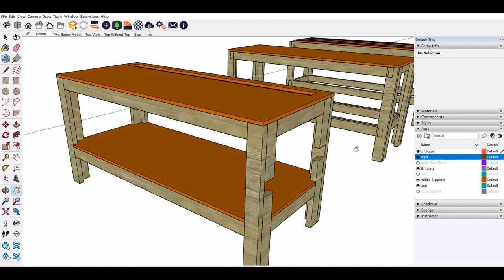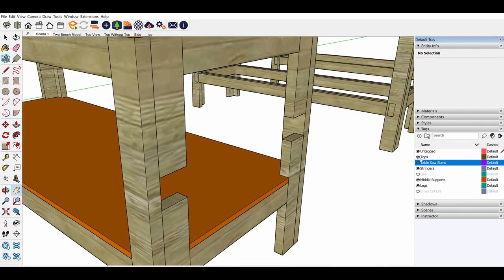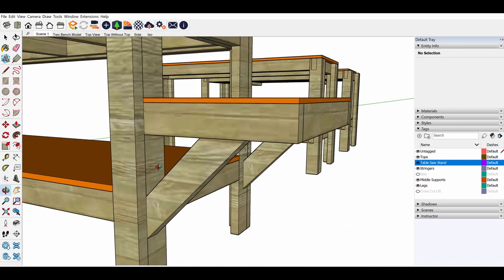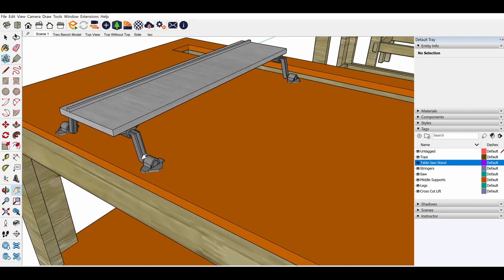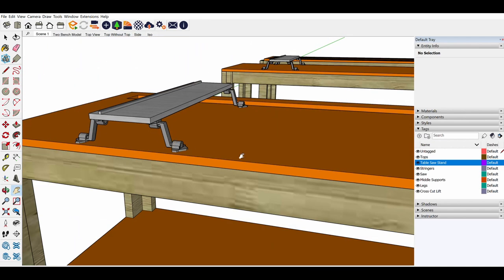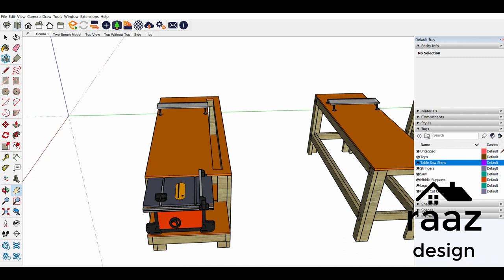Then add a sacrificial top - I use three-quarter inch plywood because that's what I had. I just screw and glue it so I can replace it when it gets too beat up. For the table saw stand, I notched out a little bit of the leg so I could run a support through and screw that in really strong, then add kickers. If you're interested in making this, you can download the plans on the website - it'll have the crosscut lift in the SketchUp file. I also have these in STL files if you just want to print them. Thanks for watching, let me know if you build one of your own.